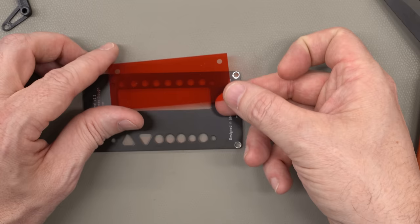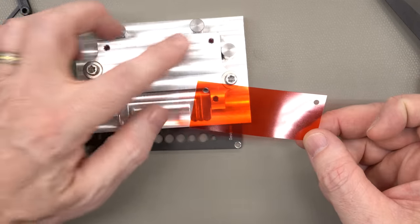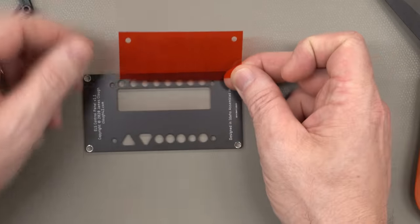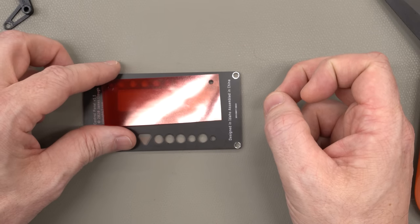So we might as well just make the lenses smaller, cut out that operation, cut out the tool change. I can still use the fixture to drill the top two holes. In fact, I could even do that on a drill press. Should take a lot of labor out.